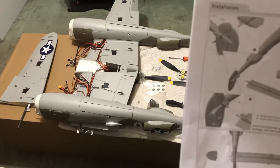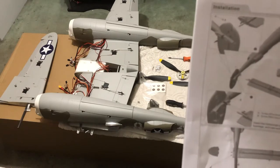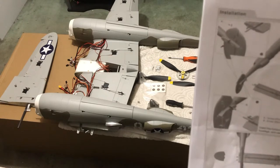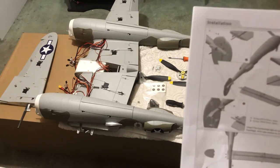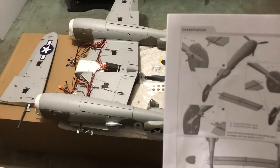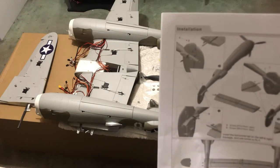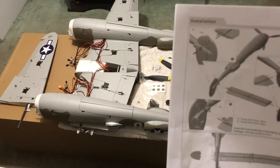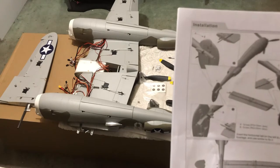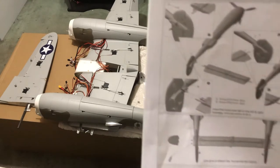So it's not really a feel thing with tightening this screw. It's more of a sound thing. You want to start listening for that carbon rod to start cracking and popping. As soon as you hear that little cracking sound, you stop and leave it right there, because that's merely putting pressure on that carbon rod.